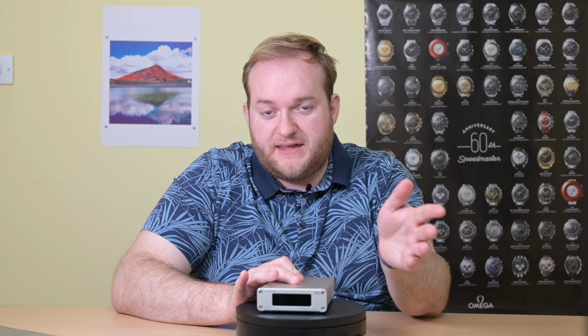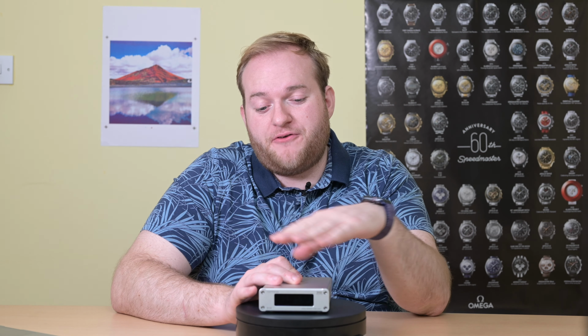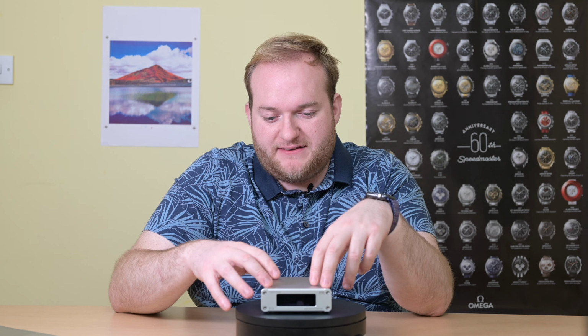Essentially, what they do is they take the digital signal that your laptop has created and they convert it to an analog signal that your hi-fi understands. Now, yes, of course, your laptop and computer can already do this. The thing is, the components that they use are, generally speaking, extremely cheap. Even the best inbuilt digital to analog converter is pretty rubbish in comparison to something like this.